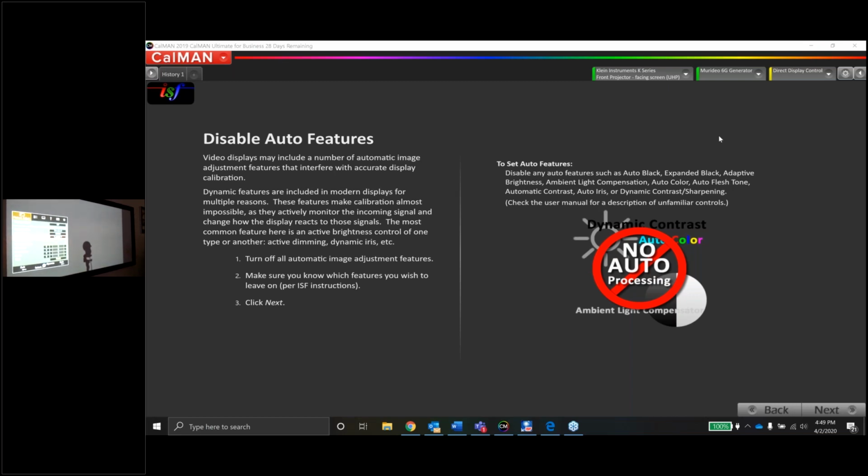So let's go back up here and just go through the rest of them. Like I said, I'm pretty sure all this stuff is already turned off, but we'll double check. Input level standard, thanks to Chris's tip. Color space is auto, that's fine. Aspect is 16:9, HDMI EDID, okay, that's all good. Pixel adjust, installation style, anamorphic's off, high altitude's off, screen adjust is off. And nothing there that we need to worry about. And the eco mode in here is turned off, so that's all good. And then back to the information screen. Okay, great. So we're good here. All the eco stuff is turned off.